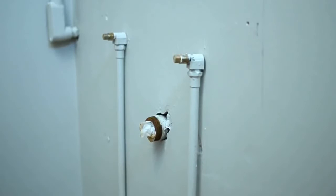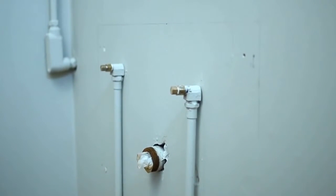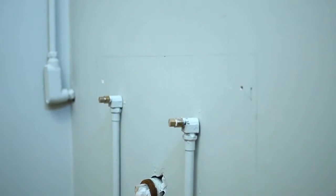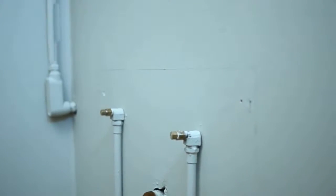We've pre-checked, we've drilled with smaller holes and it checked, and there's actually no wood back behind there. So what we're going to have to do on this application is use toggle bolts. Drill through the plaster and the toggle bolt holes on the back side of the plaster. Now, as Tripp was just sharing with us, this installation is going into a plaster wall, and we're using toggle bolts to prevent the brackets from pulling out of the wall.